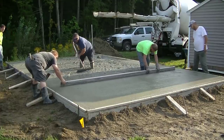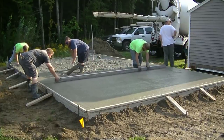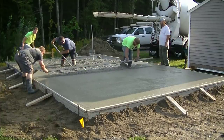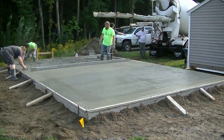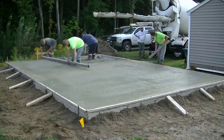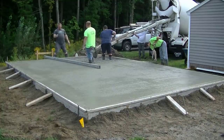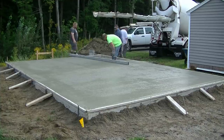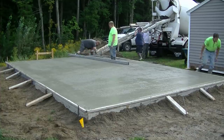We put a six mil vapor barrier under there and then tied in that new fiber rebar — this is the first job we're using it on. What's pretty cool is it comes in bundles of 25, each 20 feet long. With typical number three steel rebar you can't pick up 25 of those at a time, but with these you could easily pick up two of those 25-bundle packs — one person — and carry them around. They're that light and they're stronger, so definitely the way we think we're going to start going.